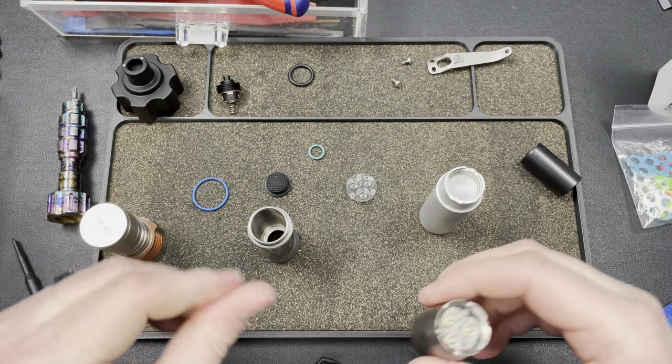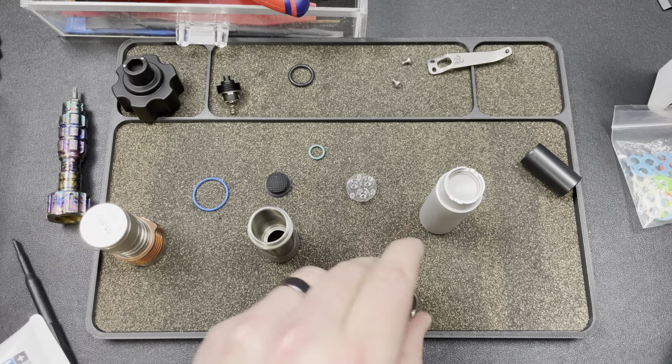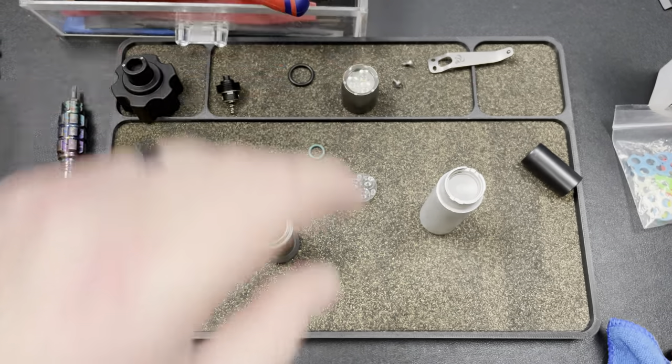We're hand tightening because with tritium, if you over tighten it, you are bound to break the tritium vial because it literally gets seated - you drill through the top of the optic, you drill through those legs, and you push a tritium vial in. So it's up against the top of the optic. If you over tighten it, you're bound to pop the tritium. And you can ask me how I know that - the answer is because I popped the shit out of some of these. Head complete.